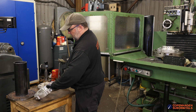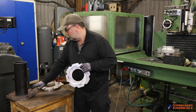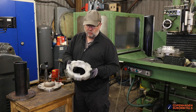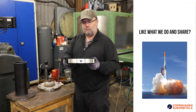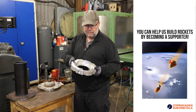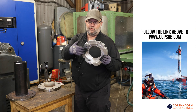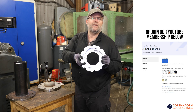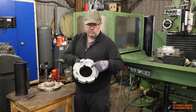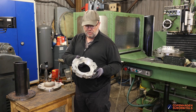We needed to do a new piece which basically sandwiches the injector between those two elements. We opted for a manifold which will have four individual fuel inlets, essentially to make sure we have a jet of fuel going in across the injector. We put some vanes in here to sort of spiral the flow a little bit. It also means that the fuel filter will fit on the inner circumference of this one and be kept in place.